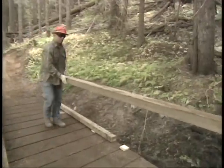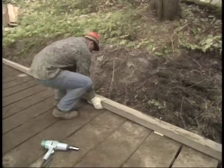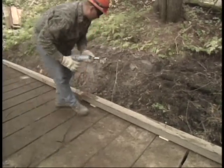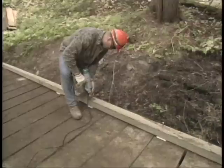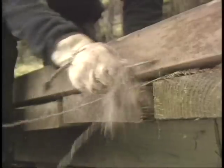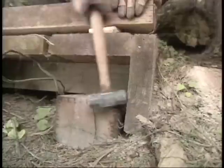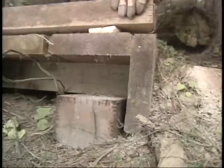Puncheon maintenance consists of replacing rotted, broken, or split running planks, decking, stringers, or curb logs. Where gravel, soil, or wood surface material has washed away, it should be replaced. Clean ditches and make sure that drainage is clear under curb logs. Check the bulkhead or backing plate for rot and replace if necessary.